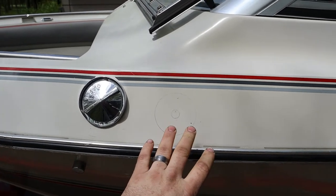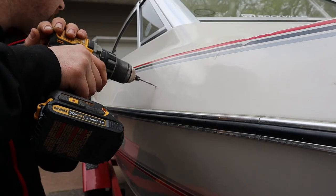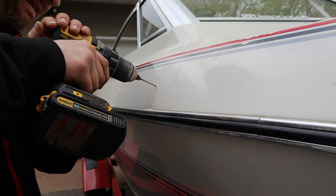Another big thing to note: make sure you're going to clear any obstacles on the back side of whatever you're drilling through. On this side my biggest concern was the fuel fill neck — I verified it goes straight down so there's nothing in the way, and there's nothing in the way on the other side either. Once you have these measured out and marked, you can do the scariest part of the entire project — drilling massive half-inch holes into your hull. Once you have everything marked out, it's time to drill your pilot hole and then the big hole.